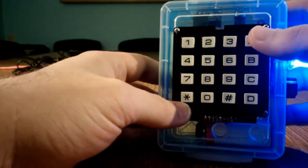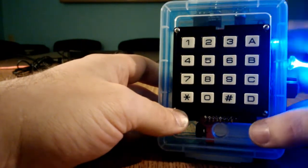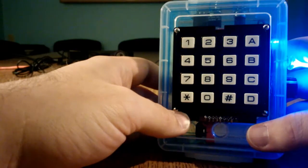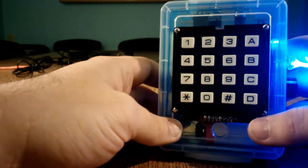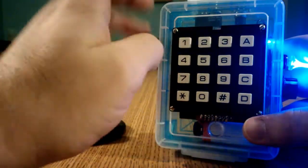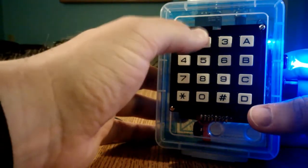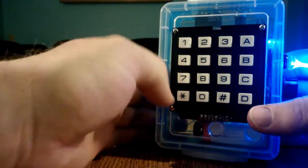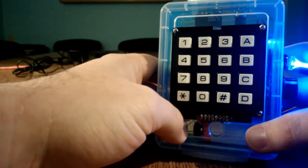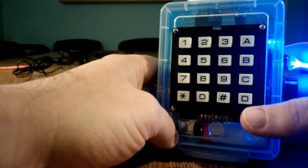One final mode is you hold in A again and you'll hear three tones. These three tones signify that the system is now in SS4, or System Signaling Number 4 switch mode. And this is a hell of a lot different than MF tones. This doesn't even use MF, actually. It uses a binary system, and each number is represented by a nibble. A nibble is 4 bits, and bits meaning 1 or 0. The 1 is represented by 2400 Hz, and the 0 is represented by 2040 Hz.